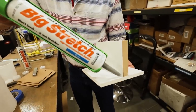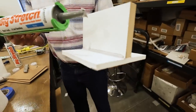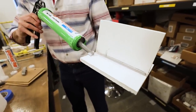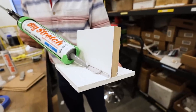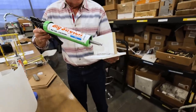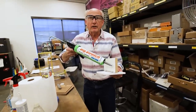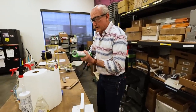So if you're too high, you're going to scrape out too much caulking. Oh yeah, look at that. If you're not parallel, it's not happening. If you're too low, you're going to go lumpy like the 90 degree one as well, and you're going to use more caulking. So always keep parallel to the 45 degree cut. Love it. Great advice, Les.